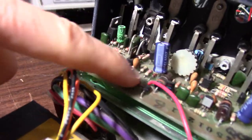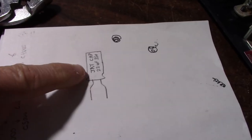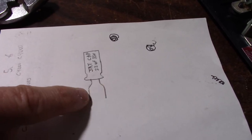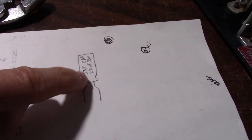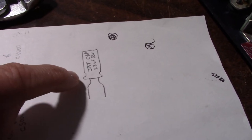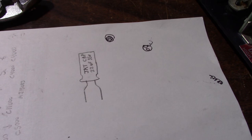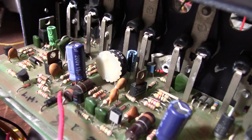Some of these components are so close together I couldn't mount the cap all the way down on the board. One little tip with capacitors: I always pre-form the leads if the holes don't match up. If you just shove it in, you could be stretching that rubber bung on the bottom of the capacitor where the lead goes in, which could possibly cause a slow leak. Pre-form the leads to match the hole spacing, then put it in the board.